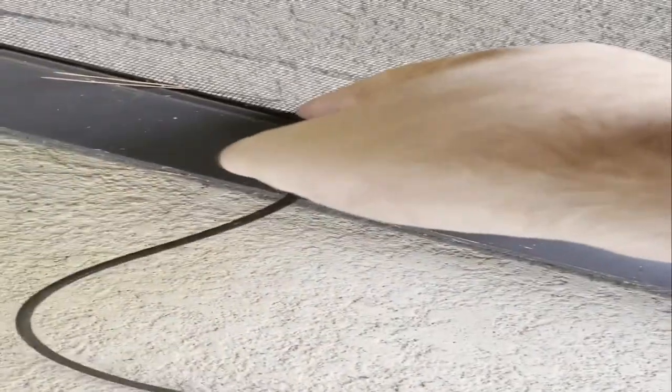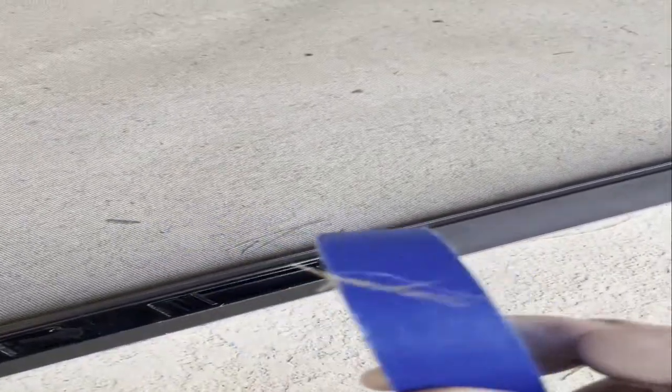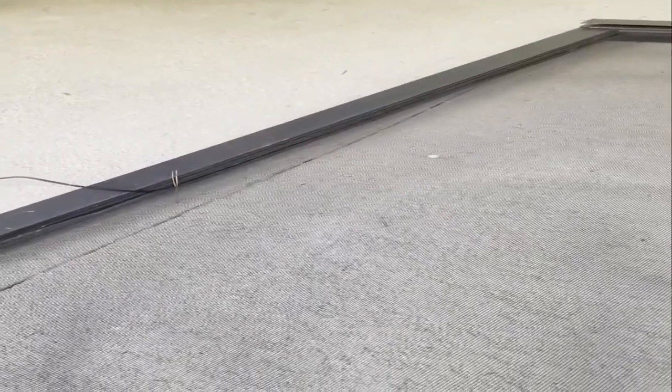Be real careful — we have a little pulling up on the bottom too, so I'm going to try to fix that as well. I'm going to go past the corner here and just pull up to about here. My plan is I have to get the screen taut along all the edges to get it back in the grooves as much as possible. I'm going to try to use tape to get that going, and as long as I can get it in there I should be able to push this down. Maybe I'll just leave the blue painters tape in there for now so we have a functioning screen.